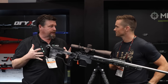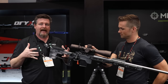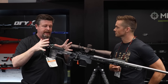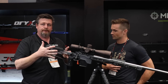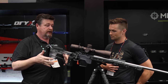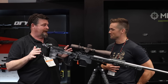As we build these rifles heavier — 20, 22, 24, 26, 28 pounds — when you pull the trigger that energy has to go somewhere. We're guiding it all into the shooter or through the chassis system to eliminate torque. So we put vibration dampeners in the chassis, giving that energy a place to go. We're controlling the harmonics so we receive stable, predictable harmonics back through the action — not craziness happening through the whole chassis. It's amazingly different. Keith has actually shot this chassis in a match.